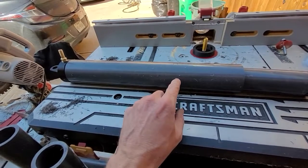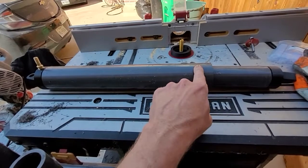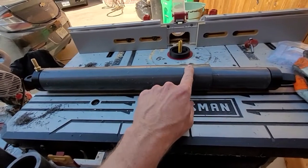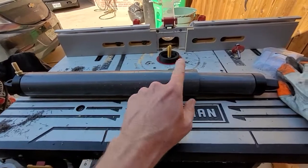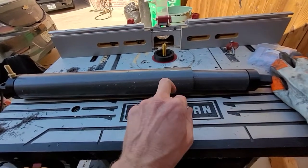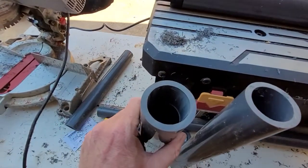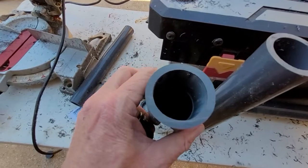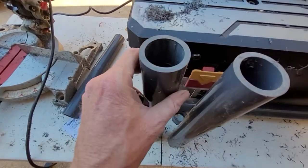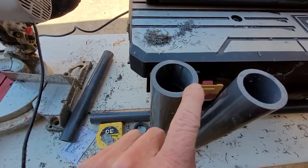For this tube right here, I had to go and get it bored out because, in theory, this tube fits inside of this tube. But because the wall thickness is whatever it is — they don't care — you can't fit this tube inside of here without it binding up, because it's not on center. On some sides there's a lot of material missing, and on other sides there's zero material missing, so the wall thickness is all over the place.